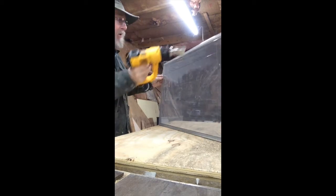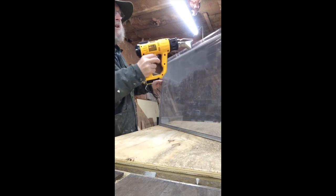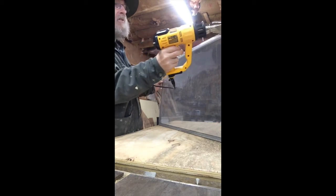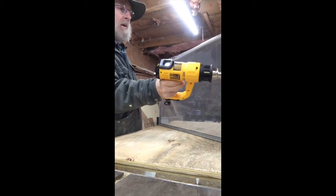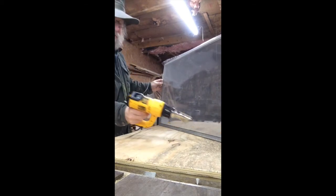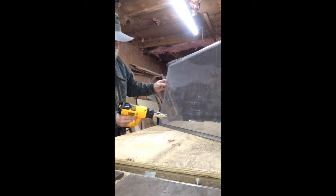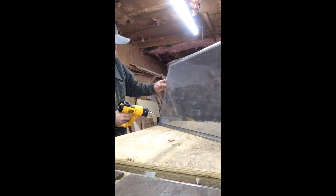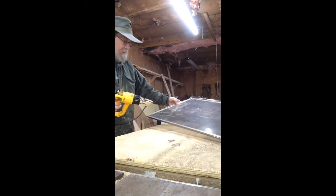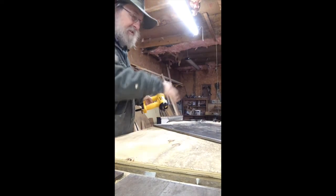Make sure you have a good grip. It's much easier to do this laying down, but I stood it up so you could actually see the process. The heat gun does a much quicker job because this one's a thousand degrees - a hairdryer is probably five or six hundred, but it will work. I've done it many times. I just made a mistake though: I had it standing up instead of laying down and I couldn't see it - I burnt a hole in it.